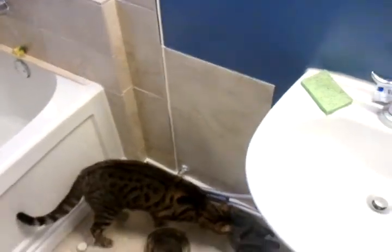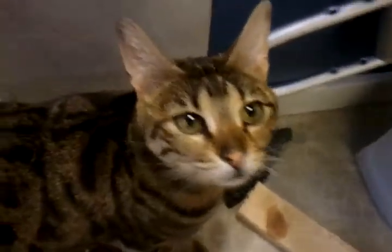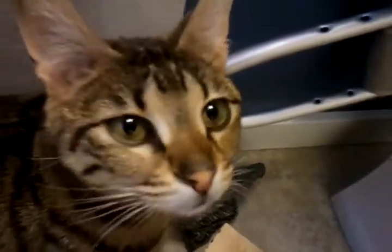So this is the bathroom pretty much done. Kitty is helping — she's been a good assistant. I am using crutches to hold the baseboard on the front of the tub since you can't nail it there, to make it all nice across the front of the bathtub and hide the edge of the linoleum.